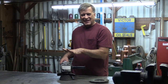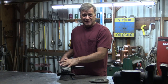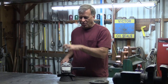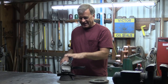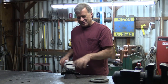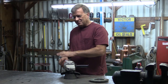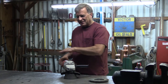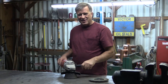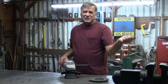This is a little more sparky and a lot more aggressive, so if you tip it or dig in at all, it's going to leave a gouge. You've got to keep that flat — straight, smooth, no pressure. Just let the weight of the grinder do the work, work it back and forth. It'll take off high spots, take off the spatter, clean up any rust in the way — just slicker than all get out.